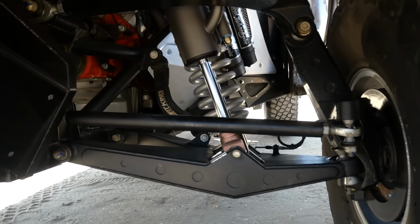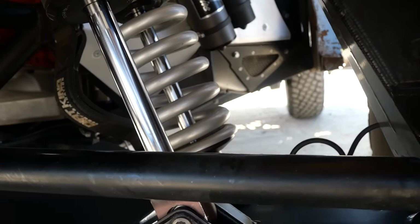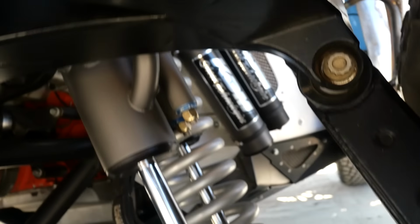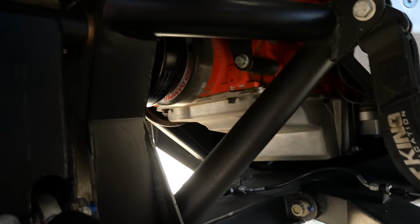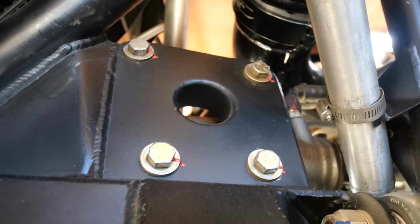Wheel there too. Now, like Eric said, originally we were running a 2.5 coilover. So now we're 3-inch coilover, 4-inch Fox, and then you can see it's also swing steer. So there's a steering box in here with Jubera's own extended sector shaft, which is a big extension from the sector shaft, and I think that's their own machine part. So you can run a regular 4-bolt box up there and then bolt that thing on.